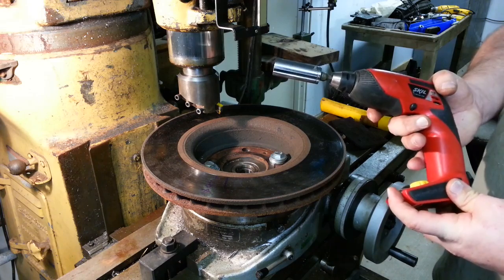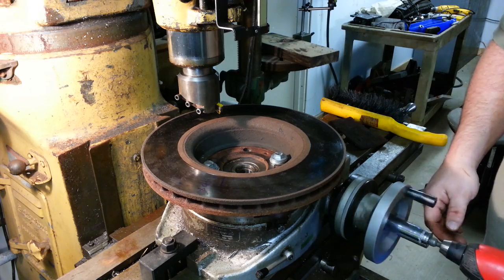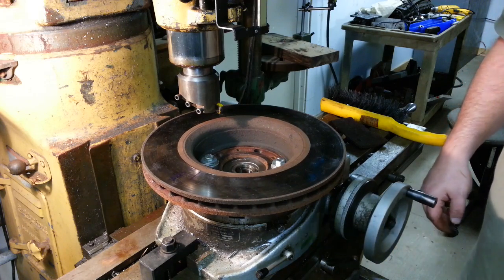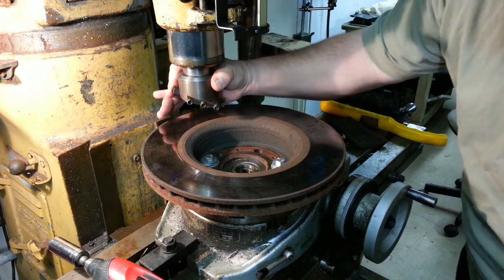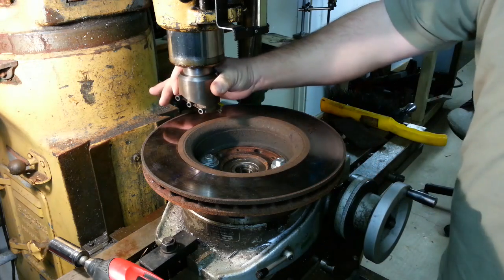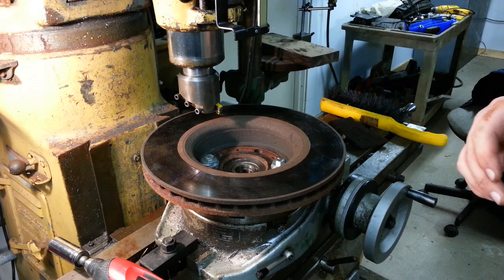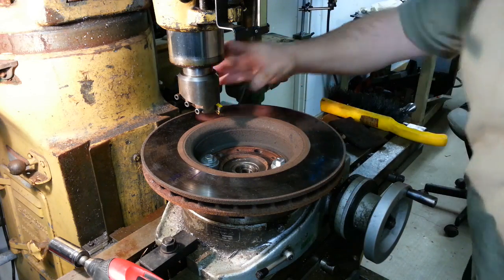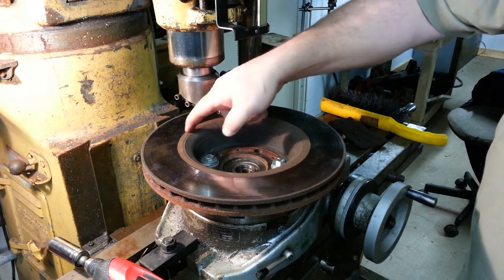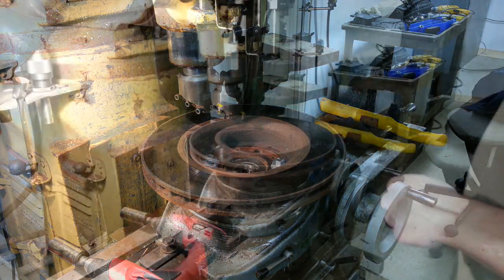What I've got here is just a battery-powered cordless driver drill and it actually spins pretty slowly, so what I can do is just turn that slow and I'll get basically a power feed on my rotary table. For the actual cutting tool, what I've got here is a fly cutter for Bridgeport — it's a face engagement the way it mounts to the spindle — and I've got an indexable carbide tool in there. I'm going to fly cut this. I've got it a little off-center but the fly cutter covers a distance much larger than this. I'm going to drop this down and machine the whole surface until I have a consistent surface with a good finish.